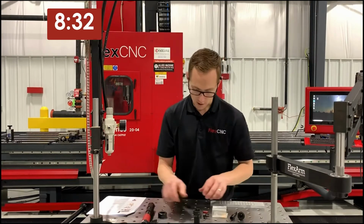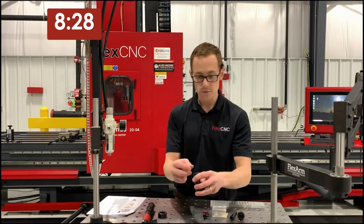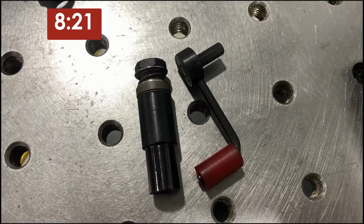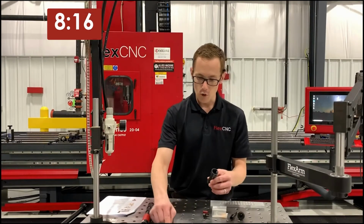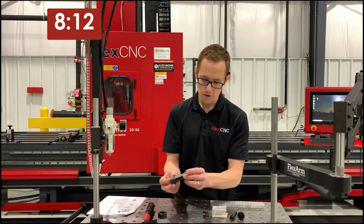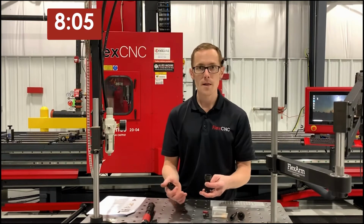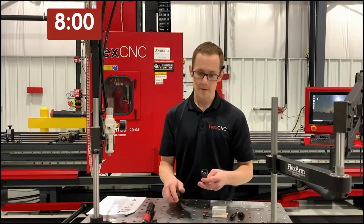The other component I'll show you is a friction clutch. The friction clutch is used with our small adapter for your small helicoils. So anything from 256 to 440 is what I'm going to recommend the friction clutch for. In the small adapter, we pull out the stock insert and we put in the friction clutch. This is just really going to help us with those smaller holes to limit the torque and stop us from damaging our front end assembly or the threads that we're repairing.